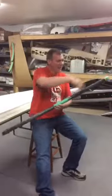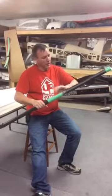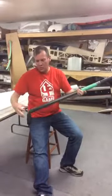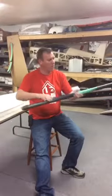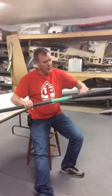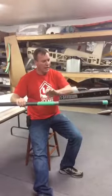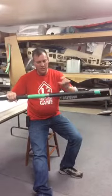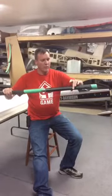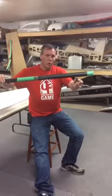So then I wetted down the tube, slid the dry piece over it, and then I pulled on it to really saturate down in there. Then I brush a little bit of epoxy back on it, and I rub it until I take all the excess to the ends here, and there's not a lot there. And then it's really a nice and dry, true carbon fiber looking tube.